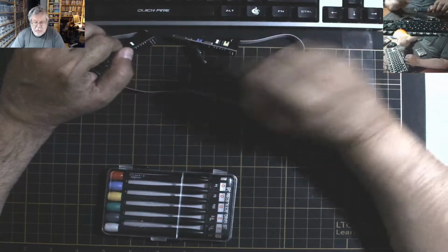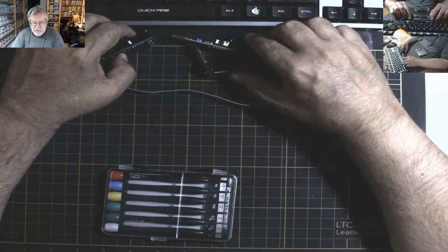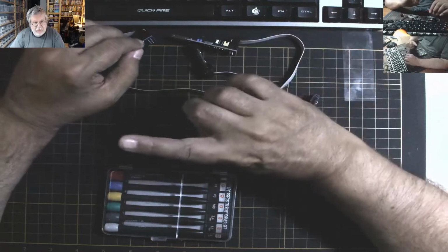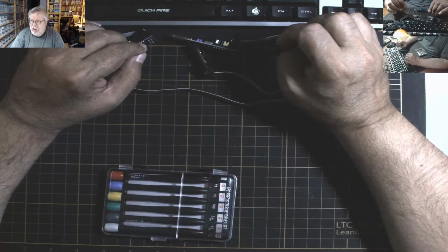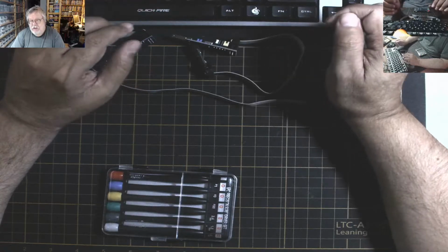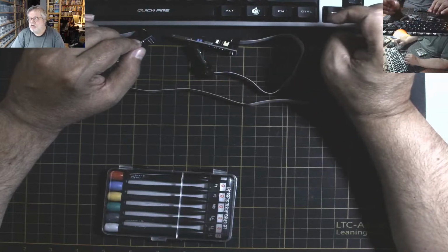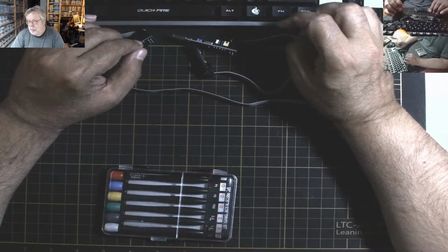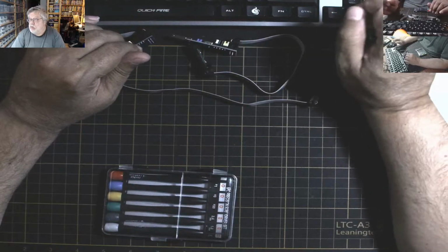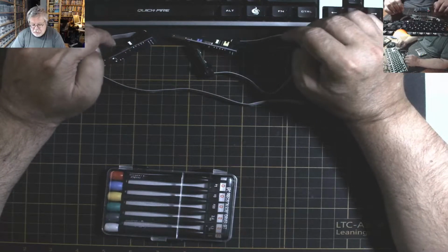The only way I got into the 0.001 offsets, and yes, it does make a difference, is in the Prusa Slicer. Once I got the ballpark on the bed, I think currently it's at minus 0.45, right? I was working on the last bed. I had to make it minus 0.46 or something like that, or 0.47. Then I was getting into the ballpark even closer. And then I did, I think, minus 0.473 or 2. And that's how I got the really good small circles. But it still left the four corners being a nuisance.